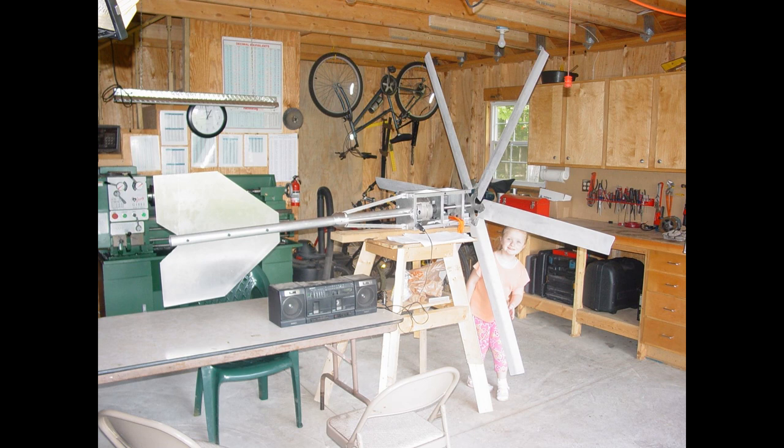In this photo you can see the wind generator head in the workshop — I had my daughter there. What I did for her was hook up a radio, and when you turn the blades at a very slow speed the radio will actually play. You don't even have to do a complete revolution — you can turn them partially or even back and forth and the thing creates enough power to run that radio easily. That's why I chose the permanent magnet alternator as the way I'm generating power.